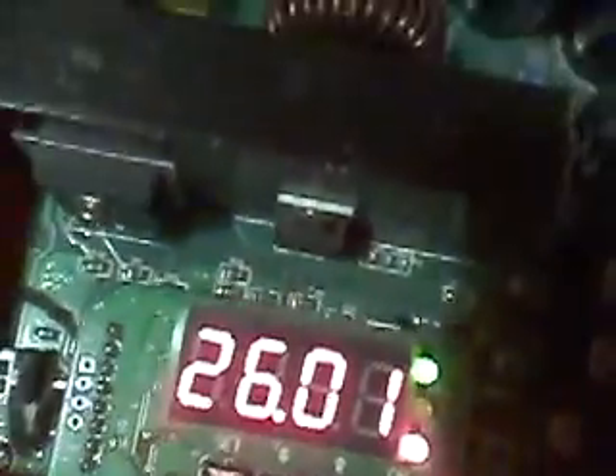I've got the LEDs running but the only problem is the amount of power conversion is very bad. I'm driving about 300 milliamps — 40 milliamps for the meter, and this box that boosts the power up uses about 50 milliamps, boosting up to drive the oscillator circuit. So subtracting 50 milliamps from 270, that leaves around 220 milliamps basically going into the coils.